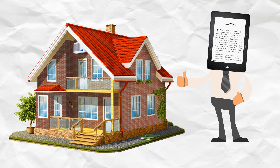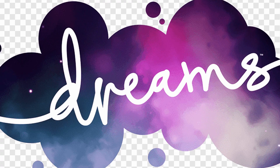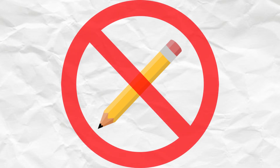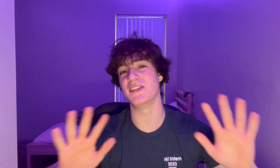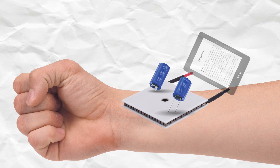So after the e-paper display showed up, I thought, what the heck, I've invested $20 into this, I might as well just do it. So I dreamed up a schematic in my head without drawing anything on paper, ordered a bunch of parts haphazardly, and waited. The watch would be amazing. It would charge based off of the heat on your skin using a thermoelectric generator, use supercapacitors instead of batteries, and it would use an e-paper display, meaning you would really never have to charge it. It didn't even need an on-off switch because it was always going to be active. But then the trouble began.